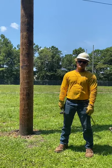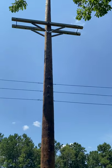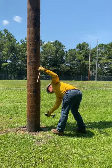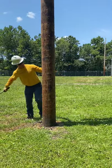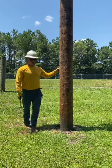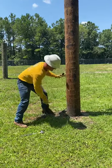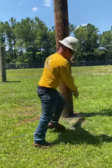Before you climb a pole, you have to make sure it's not rotten and you have to test the pole. First, look up the pole and make sure you don't see any shelling, rot, or bird holes. Then you're going to start sounding the pole — hit it on all four quarters, making sure it's got a hard thump. You don't want a low hollow thump, as that means the pole is rotten. You've also got a probe — stab it four times in each quarter at different depths, making sure the pole is not rotting at the base. The last thing you want is to be climbing a rotten pole and have it fall over on top of you.